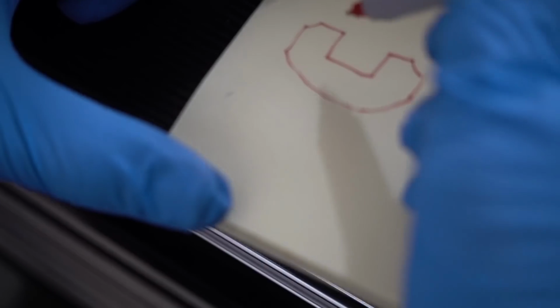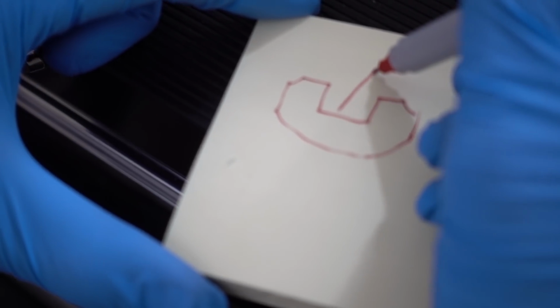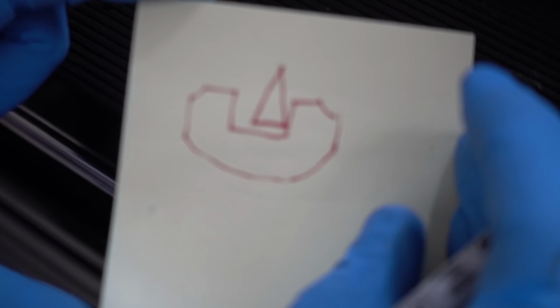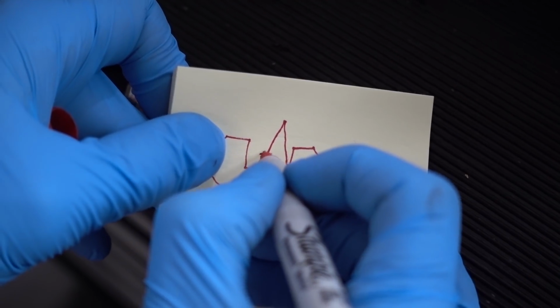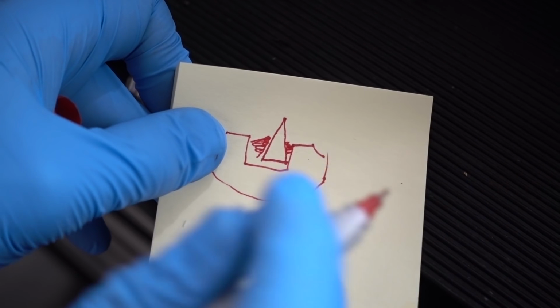If you've got the groove of your ring like this, so here's a side profile of the ring, you want to put pieces in. If all the pieces were a perfect triangle, it'd be super easy, but no pieces are perfect, all of them are a little bit different. Basically, try to have the widest part of the inlay material at the bottom of it, that way we can build up our powder around it, and it's wedged in place.